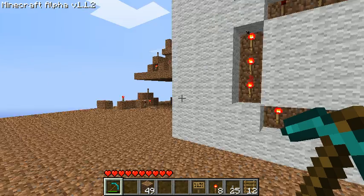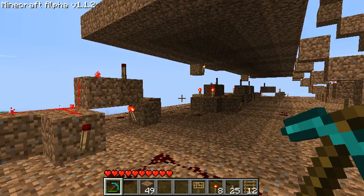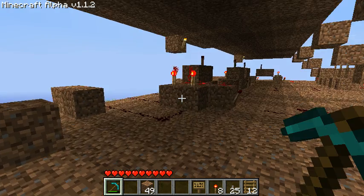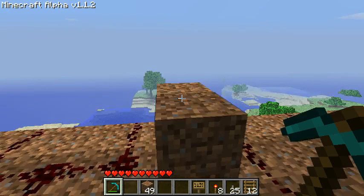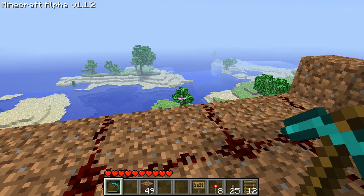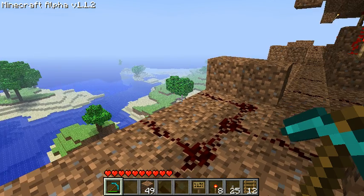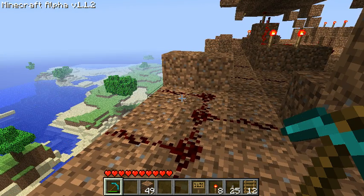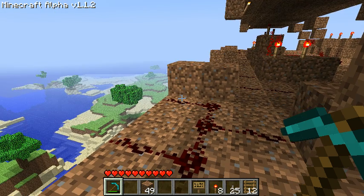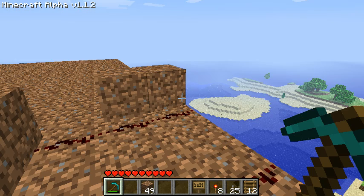Now that we have some light, let's take a look at these logic gates. These gates are 10 in total, one set up for each digit, with connectors made here with four pins. One on the far left — of course, those pins are for the 8, 4, 2, and 1 digits in binary.